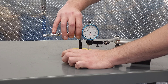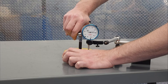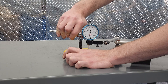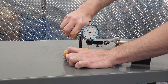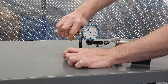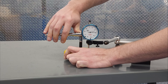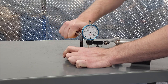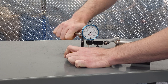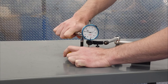People sometimes take a minute to grasp that the foot itself expands when the stud is tightened. It's easy to see when I set up this dial indicator to measure the height of the surface of the pad. As I crank the stud clockwise, the top of the pad raises. In this video I raise it about 200 thou, and the maximum range is around a half an inch. That's more than enough to take up variation in all but the jankiest concrete floors, and if you need more than that, you can always shim below the pad.